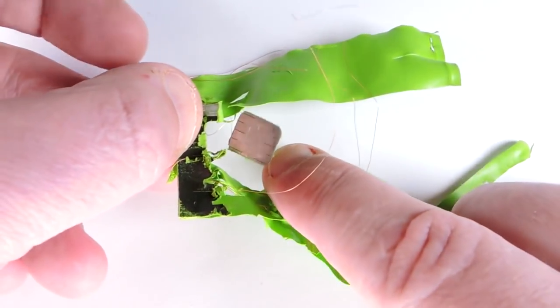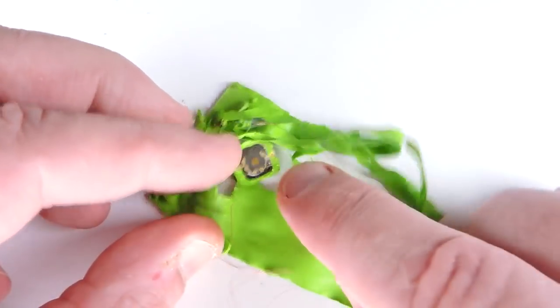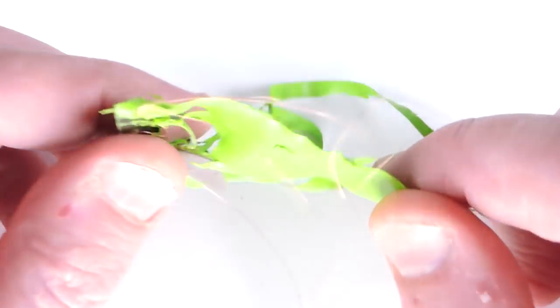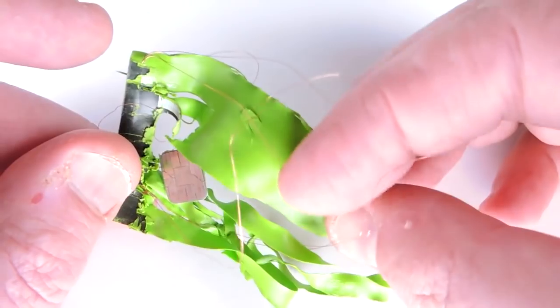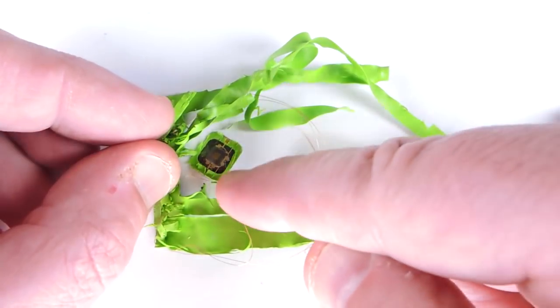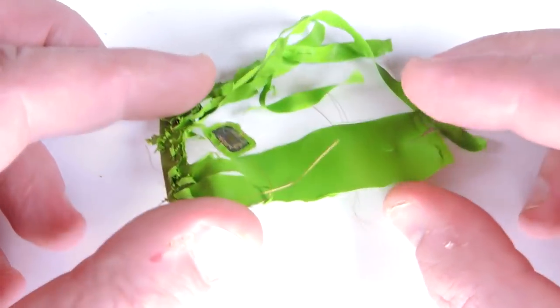This is the contact interface, of course, you'd always see on a credit card. If you flip it over, you can recognize the circuit board. There's a little integrated circuit there — we'll zoom into that in a second and analyze it in depth. The other interesting thing is you can see some very fine wire, and this is the antenna for the contactless portion of the device. Interestingly, this credit card is quite sophisticated — it looks like this one piece of silicon does both the contact and contactless variations.